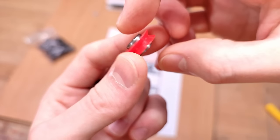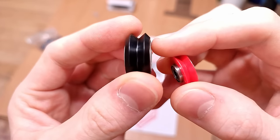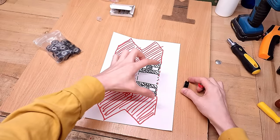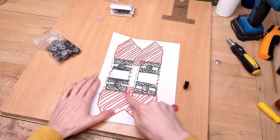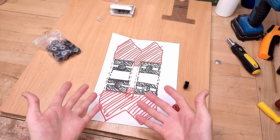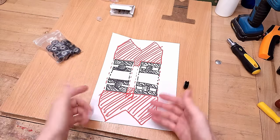I need to make new, wider V-groove sleeves for two bearings each, identical to those off-the-shelf ones, because if you take a look at their cross-section, they don't just have a hole straight through, but a little ridge in the middle for the bearings to butt up against from each side, effectively locking that sleeve in between the bearings to prevent the exact issues I've been having.